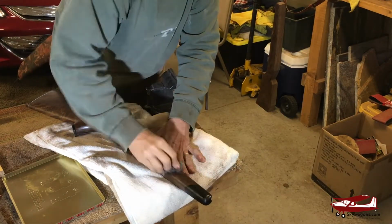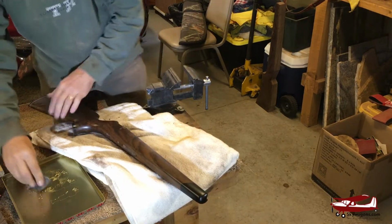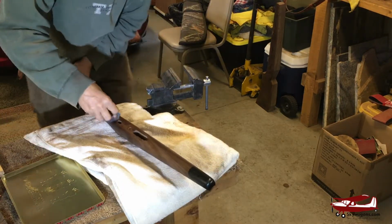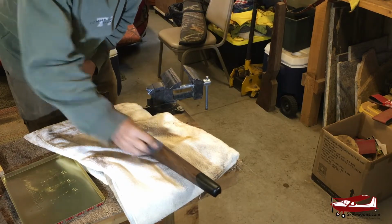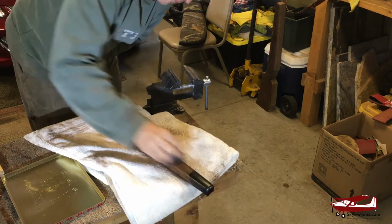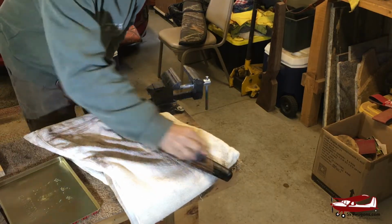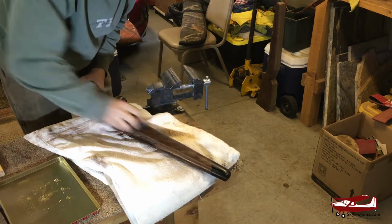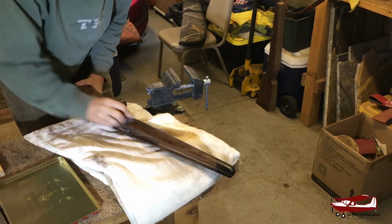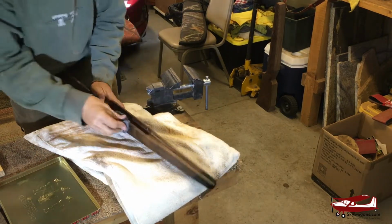So the steel wool is making sawdust, and then the sawdust is being picked up by the stickiness and then being jammed into the pores of the wood. And I just use steel wool because sandpaper just clogs up, and I want the wood to clog up. The steel wool uses a bit more of it because it soaks into it, but if they're right, it's cheap compared to the rest of the thing.